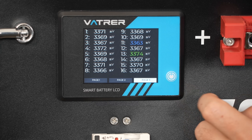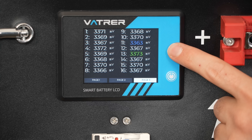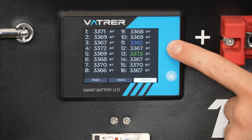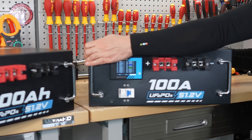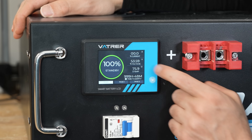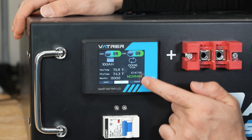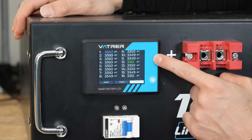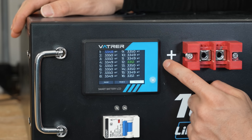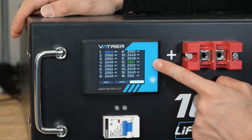On page three, we get the cell voltages. Look at the cell voltage differential — this is better than the Eco-Worthy. We're only off by 0.01 volts. And this is at 100% state of charge, so this is better than a lot of EG4 and Eco-Worthy batteries, which is crazy. Now looking at the other battery — also at 100%, after multiple cycles including high C-rate testing — the cell voltages are the same as the first battery: 0.01 volt deviation. This is better than the EG4s and the Eco-Worthy. This is what you want to see when your battery is fully charged.